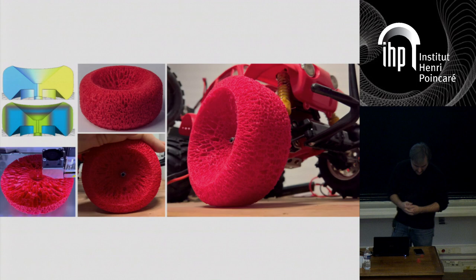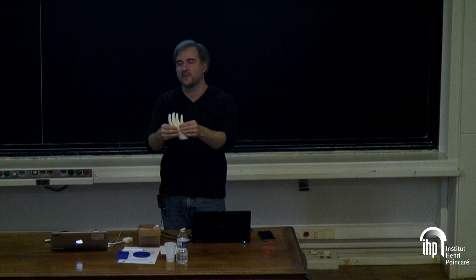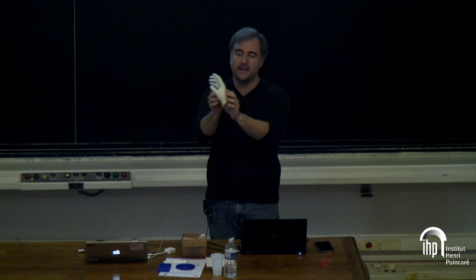So you can do this for probably less than one euro on a printer that costs about 300 euros — nothing compared to the other technologies. It flexes and so on, and you're welcome to come and try it afterwards. Many challenges remain. The one I just talked about is on the right. The one on the left is one of our early attempts — really bad mechanically because it has sharp features. The one in the middle is something we think is quite promising because it's very progressive while being regular, which means it prints fast and reliably. But we still have challenges to solve in terms of guaranteeing that it will always print properly. Everything is in our software, which is freely available for download.